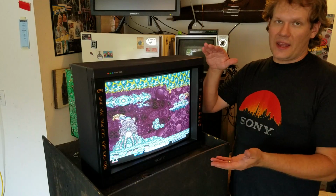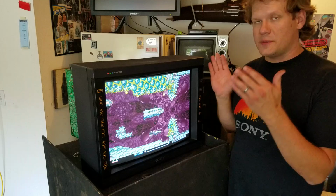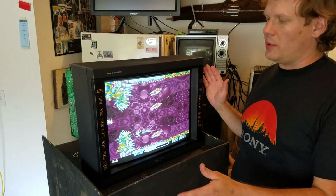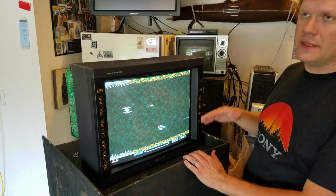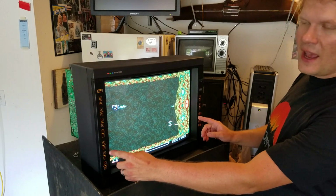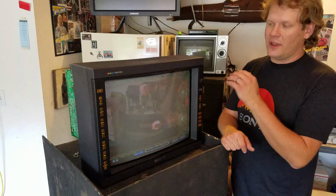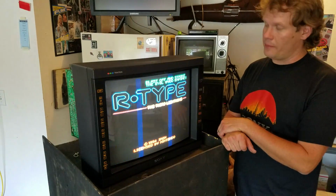I might need to expand that vertical size area, and I might need to expand the horizontal size area, because I want to make sure that when I'm running this, all the consoles that are going to be played on it, there's not going to be any black side or black top that's not intended to be there. So I want to overexpand it, so maybe on some games I might lose a scan line or two outside, but I've got the full picture then for all my media, and even a DVD or VCR or Laserdisc player.